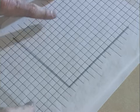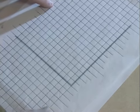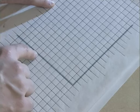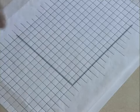So your best bet here is to pull the tiles on that side down to a point where you have full tiles on the widest part of that angle, and then as you work into the corner, you'll just take a little bit more off each one of the tiles. Visually, they'll all appear to be large tiles.